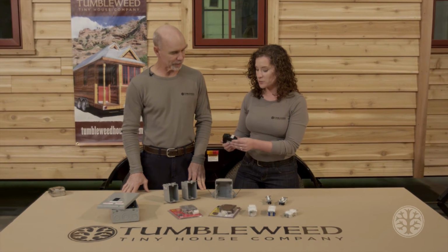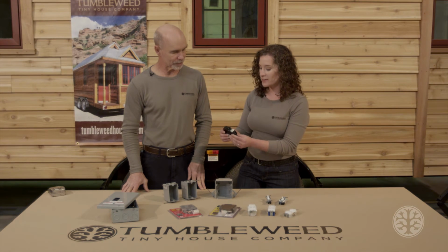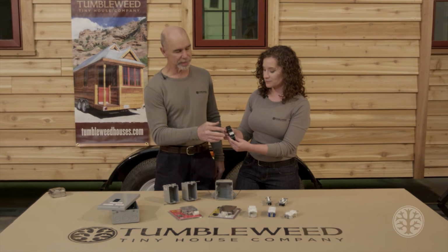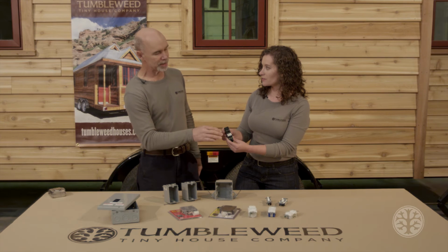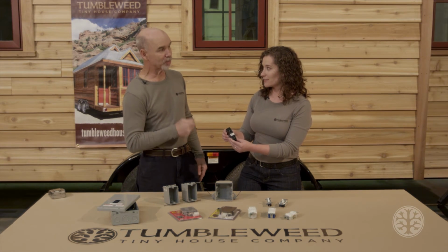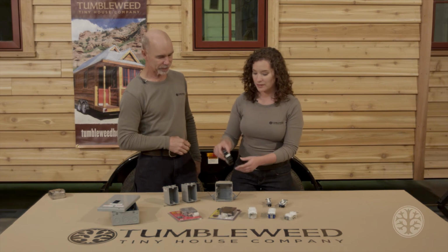Another safety feature that's been built into our electrical systems in today's world is a circuit breaker. And a circuit breaker such as this one is a standard feature that allows the electricity to be cut to the line. Now this box happens to have two different circuits in the same slot. That allows you to expand your circuits a little bit in the box. And this is a standard breaker, meaning that the only thing that will trip it is if you exceed the amperage that it's rated for, which might be quite a shock before it kicks that breaker. But if an appliance was to fail, it's going to trip the breaker.